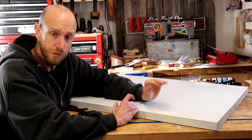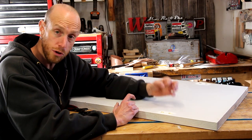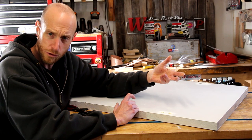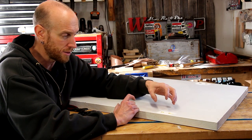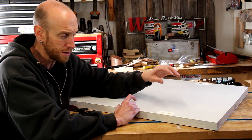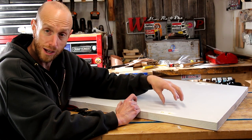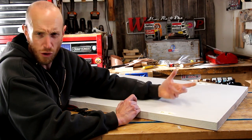The thing I really like about making a repair this way is it's still wood. You're not just filling a hole full of some material that could possibly shrink and dry up and fall out. At least there's wood plugging the hole. We're going to sand this off and top it with a little bit of filler just to make sure it's nice and smooth, but overall the hole is plugged with wood. Anytime I can repair something with wood — whether it's an application like this or fixing a stripped out screw hole with a toothpick — I just like knowing that it's real wood in there.